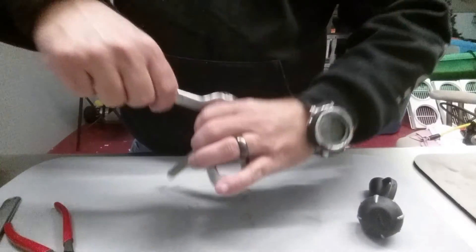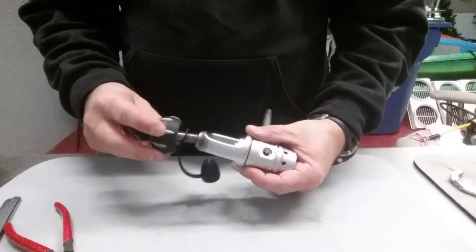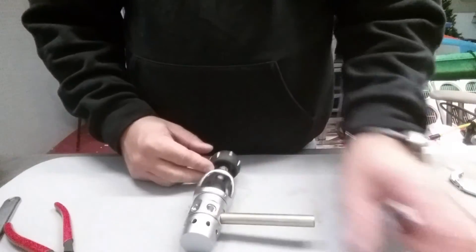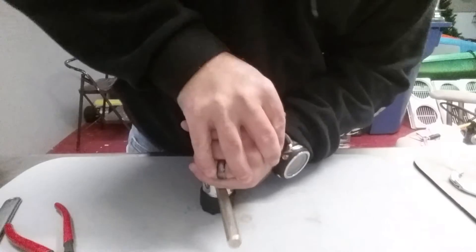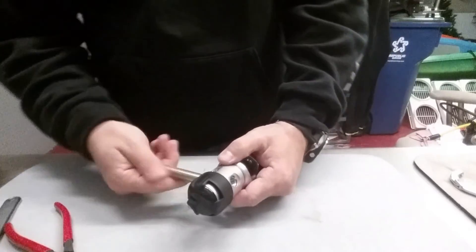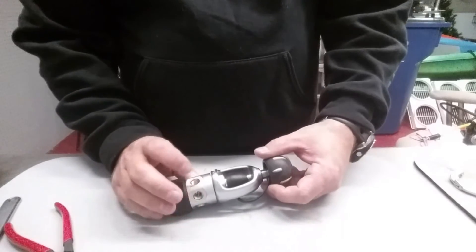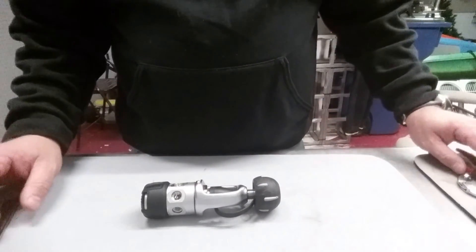Using the table as leverage, I'll make sure it's good and secure, then go ahead and replace the yoke screw and dust cap, getting them in there good and secure. The last thing is replacing the little plastic cover on the tail cap — I'll just stand it up and push down so it snaps back into place. It should turn freely on there; it's just a little groove that it locks in. I can remove my third hand and then replace the port plugs, hoses, transmitters — whatever I had originally plugged in. I usually leave that to last to make sure I get the hoses routed properly into the correct ports.